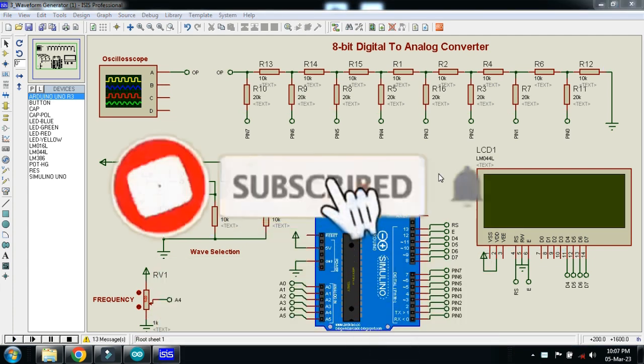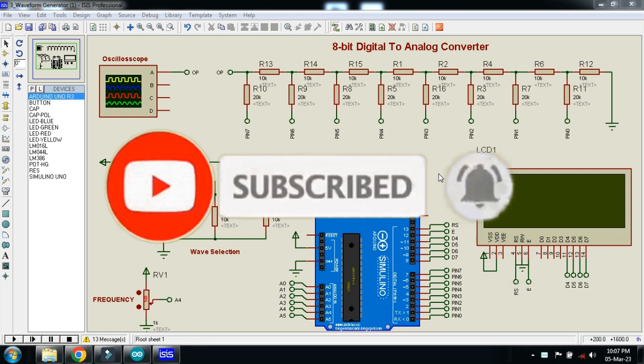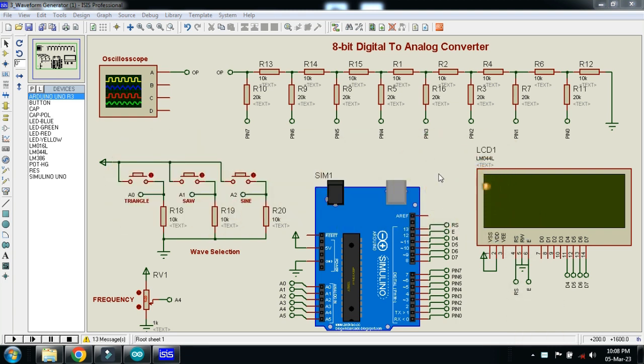In this video, you will learn how to make a waveform generator with the help of Arduino. Here you can see the 8-bit digital to analog converter, and 20 kilo ohm and 10 kilo ohm resistors are used, and the output of this is connected with the oscilloscope. All these pins are connected with the digital pins of Arduino, pin 0, pin 1, pin 2, 3, 4, up to 7. Here you can see pins 0 to 7.